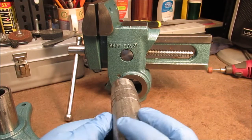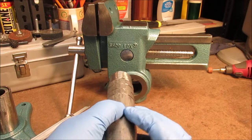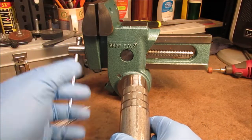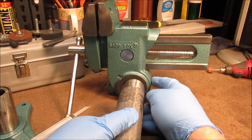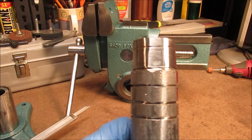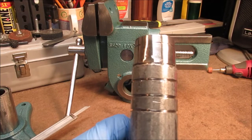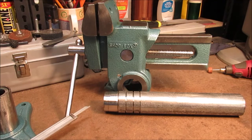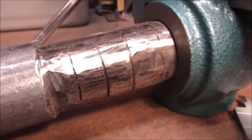This is not a rotating part - it's not a machine surface like a bearing surface, it's just to hold it there. This has a clamp; if you watch the video I'll modify it, drill and tap a hole for a bolt to lock it in position. We don't want this vice device to turn and the vice fall down smacking you. I could just lock it in whatever position I want with a bolt mod - that's a future video so stay tuned. We wanted to show you before we got too far. We're already three minutes in just talking about the job - let's get to work.